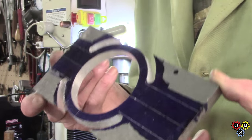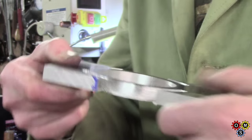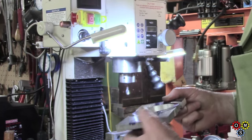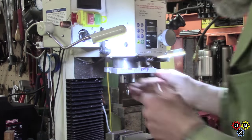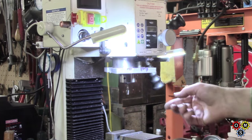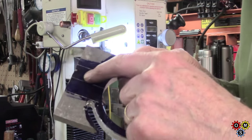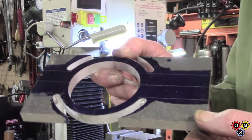Well there's our piece roughed out - I'm mucky on that side. So I've got to do cuts there and cuts there. I'll try and get my rinky dink little three-wheel bandsaw going - I've got a new blade in it. Oh, there you are, it fits! I've machined that out probably a thou or two over, hoping I could get it on, and it goes on. So the pinch bolt at this end won't have to do much work. Let's see what we can do with the bandsaw, which doesn't cut very straight, I might add.